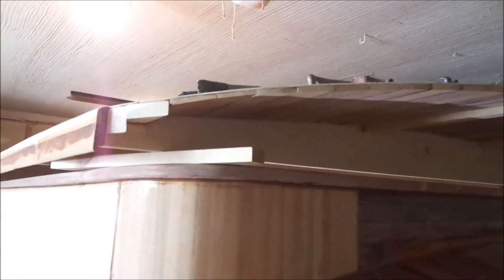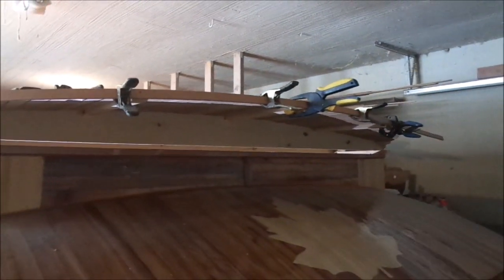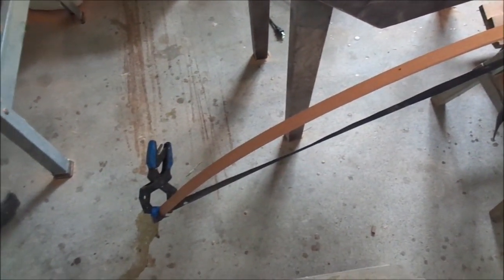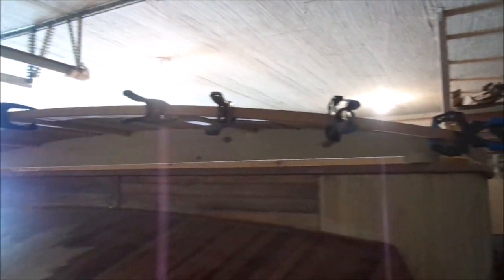I'm going to do the same along the back as well. There's the first half steamed and clamped into place — it seemed to go on very nicely. When I go to do the other half, I'll add my tire tubing on like I did previously, just to hold that in tension, and then I'll steam the other half. I now have one steamed end under tension to keep the bow in it, and I'm steaming the other end. I have the second half of the trim clamped into place. When that cools down I will screw it into place to dry-fit this piece, and then I'll be ready to start on the stern piece.